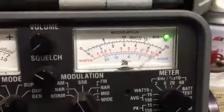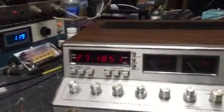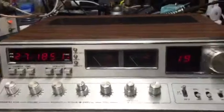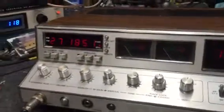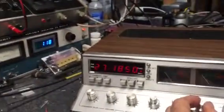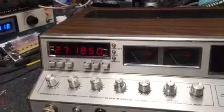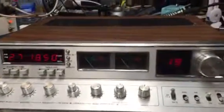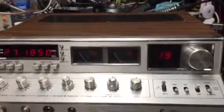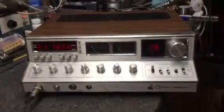Audio check — one, two, three — that's a good sounding radio and it looks good. The frequency counter is good, everything's on frequency, voice lock of course fits right in the center. It's sitting right at 27.185 MHz for channel 19. Hope you enjoy it — it's a good radio, have a good time with it.